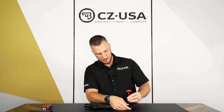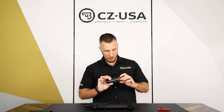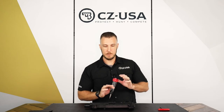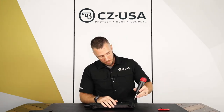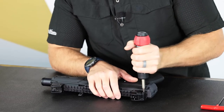The important thing here is to make sure you do not over-torque them. I just snug them down with the T-handle and then I'm gonna take my torque wrench — I've preset this one. Torque spec is 25 inch pounds. We don't want to go over that because this is a polymer rail and it can be damaged if you over-torque it. I'm gonna go ahead and torque this back on. This is gonna be the same process for the front sight.